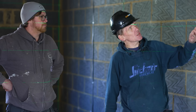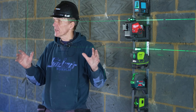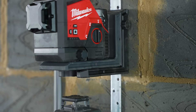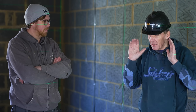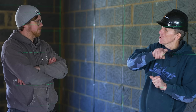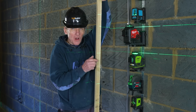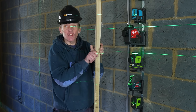If we're looking at a 360-degree laser, we're really looking at the ones with the turret — it gives you lines in every direction, which is brilliant if you're setting out stud work or tiling. The pendulum lock has two advantages: you can lock it in the case so it survives being knocked about, and you can lock it on an angle — useful in landscaping if you want to get a fall. We're going to put horizontal lines on the wall and move around the room to see if there's any discrepancy.